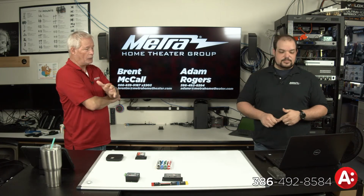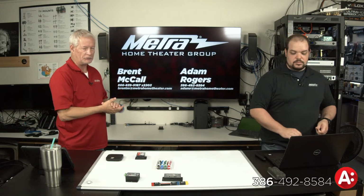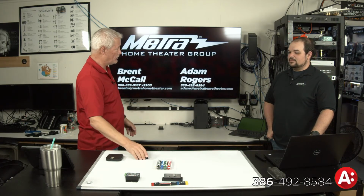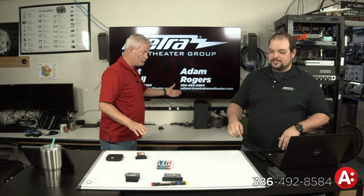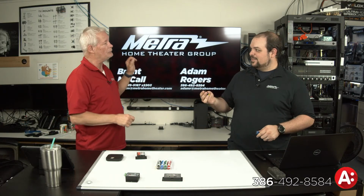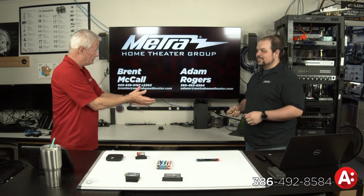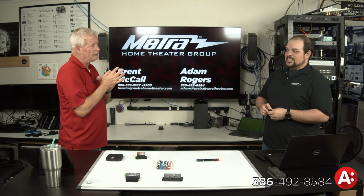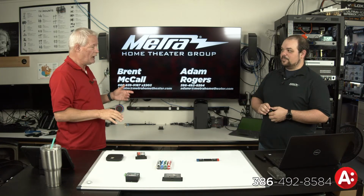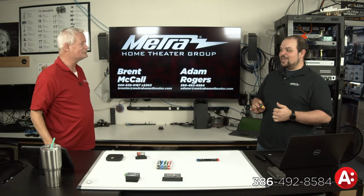Right. Typically. Now, it is possible, for example, with the Xbox Series X, we put our EDID blocking tool on it because we were curious after what we saw in here. What would happen? Well, it's quite interesting because I've never seen what happened before. It gave us a picture, which surprised me, honestly. Because normally if there's no EDID or hot plug or HDCP, there's nothing. It gave us a picture, but it was horrible. It was a 480p picture.